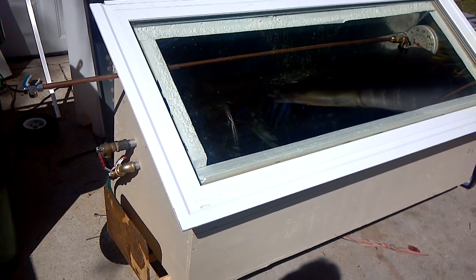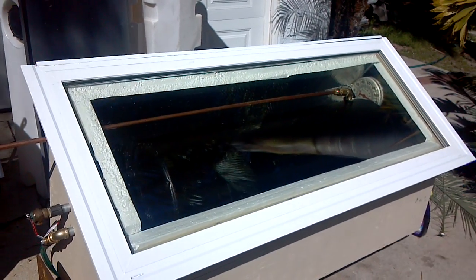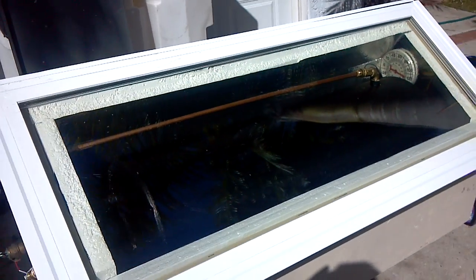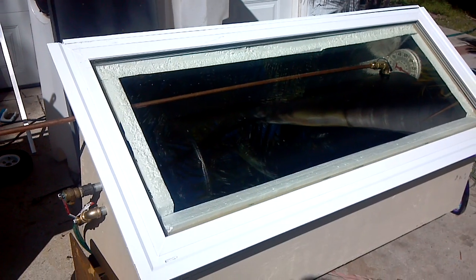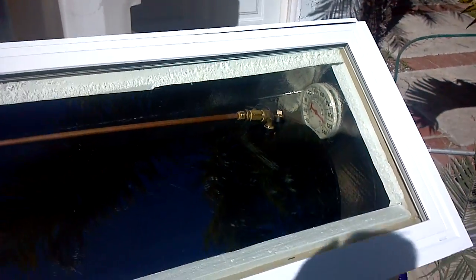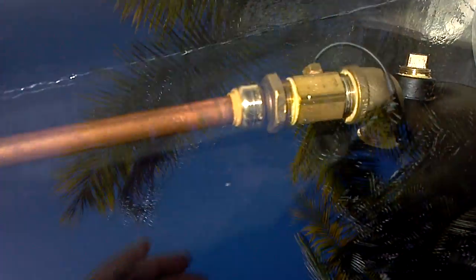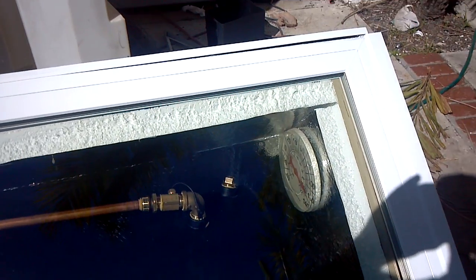So what's going to happen when I'm not there in the desert — say I go out every other weekend — if the solar heater is 5 or 10 degrees warmer than the storage tank, the pump will kick on until they equalize. And whenever I'm not around, that will continue to happen. Even though the temperature of the water may stratify, the probe to the differential temperature switch will be on the outlet tube.